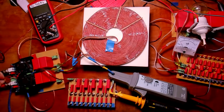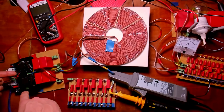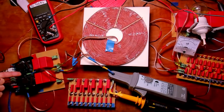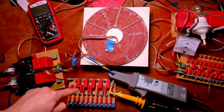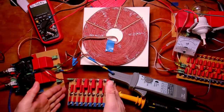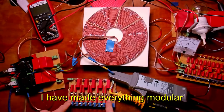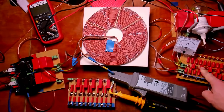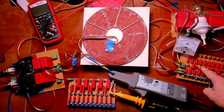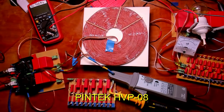The circuit is fed from a 12 volts power supply. Then from here in the center I have the connections to the coils. So one is going to the L1 and the other is going to the L2, but first it goes to the L2 tuning capacitor, and that is this switchboard. Here you see the other one. This is for tuning the L3 coil, which is parallel resonant. And this is series resonant for the L2 coil. I've got here a probe, color-coded yellow.